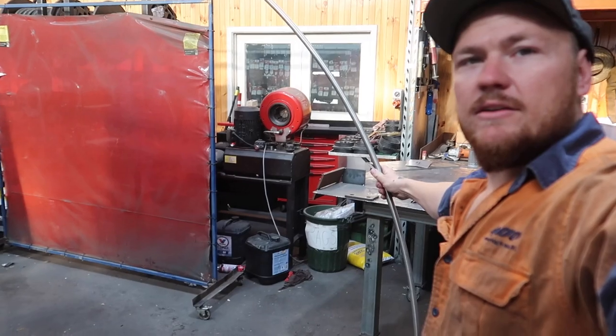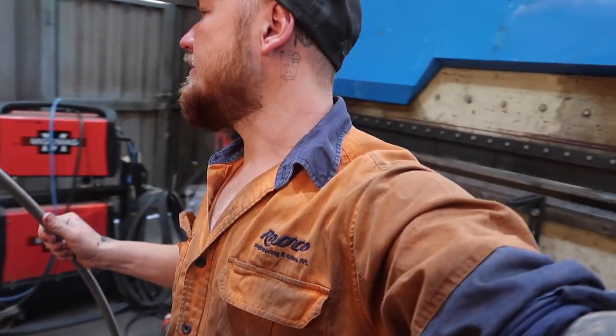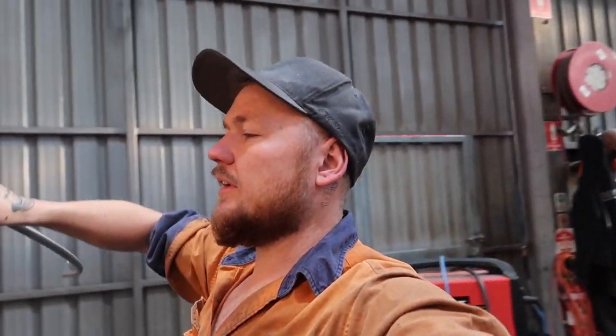I've got some three-quarter inch, or 19mm, stainless tube — measured on the outside. It's the last day of work so I wanted to get one last job done. I chucked it in the rollers — haven't recorded it but it's the same as the last video — put it through and it comes out curved. So this is it here, kind of that kind of radius.